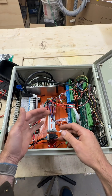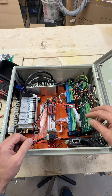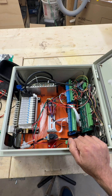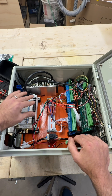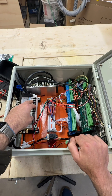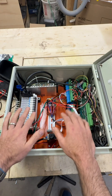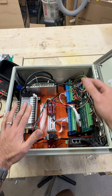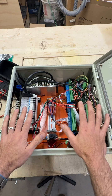For outputs, operating things like supplying air to your spindle, extending your tool rack, running the air blast which will clean off your tool holders, and any additional pneumatic accessories like a coolant mister, pop-up pins, an aggregate drill head, or whatever other pneumatic things you'd want to connect to your machine are going to utilize this 12-valve bank here. It's a really cool valve bank — you get 12 valves, very compact. It's a nice industrial unit, a lot better than using 12 individual valves for space constraints and wiring cleanliness. This really is going to handle all of the parts of the ATC: it will read the state of the spindle, read all the safety systems, and actuate all the different pneumatic things in the system.